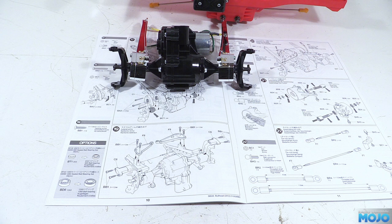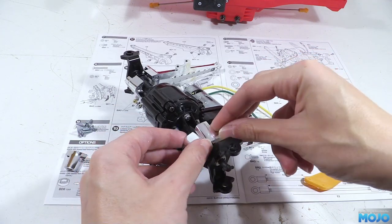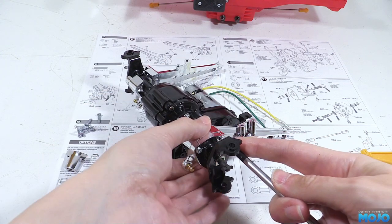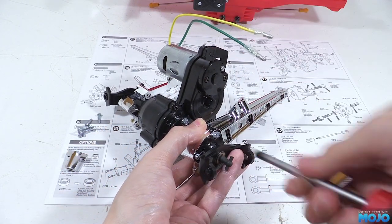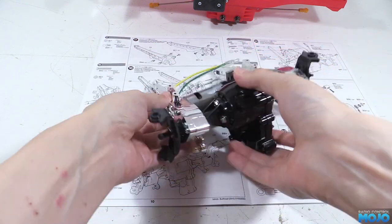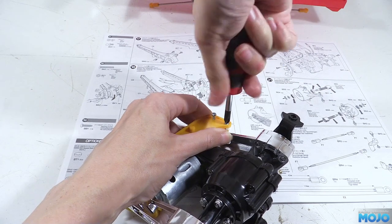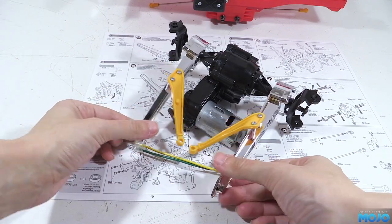Step 19: bottom bits of the ball cups and the yellow bits to keep the arms straight. For screws we need eight 3x12 self-tappers. For plastic there's two C6s, an F8 and an F9. The C6s slot into the bottom of the arms to complete the ball cup — they're a tight fit but should end up more or less flush. We don't need to add any more grease; what's already there will be plenty and it'll transfer around after the truck's been run a bit. To hold them in, use two screws from the outside — access is a bit of a fiddle and you have to rotate the arms to get the screwdriver along the side of the axle. For the yellow bits, they just screw straight into the underside of the arms. Check you've got them the right way around. F9 has an extra blind hole used in the next step. Give everything a quick check over, as after the next step it starts getting more difficult to take things apart.